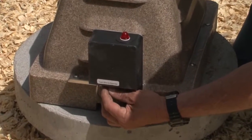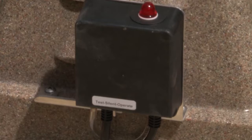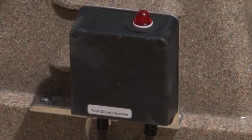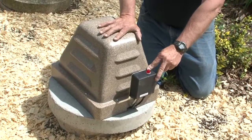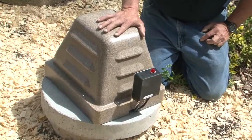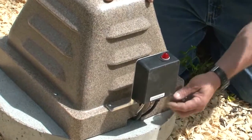This is a low pressure alarm. What it does is it lets you know that over time the diaphragms will weaken in the pump. You can get replacements for them and replace them. It lets you know that they're not putting out as much air as they did in the past, so it's time to rebuild them. If this thing goes off, it's not a dire emergency — it's not going back up in your house. You don't have to do it this minute; you can just silence the alarm, get the parts in and fix it.